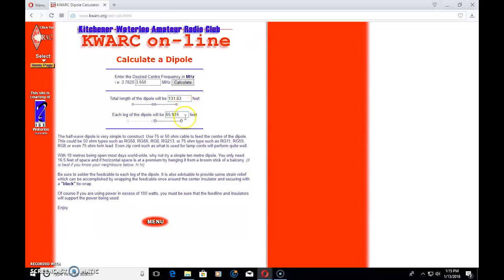Now, if you're mobile, with all the noise and conditions, a quarter-wave mobile antenna for 80 meters would need 65 feet — which is impossible. Almost every antenna for 80 and 75 is compromised, using electrically 65 feet of antenna coiled down into a reasonable length. You can make your radio happy with a 65-foot electrically long 80-meter antenna for mobile, but it's still only about five or six feet high, which doesn't make it too efficient on 80 meters. But you can absolutely do 80 mobile.